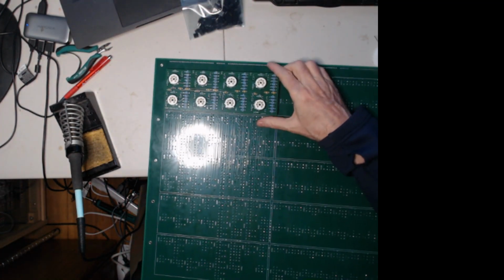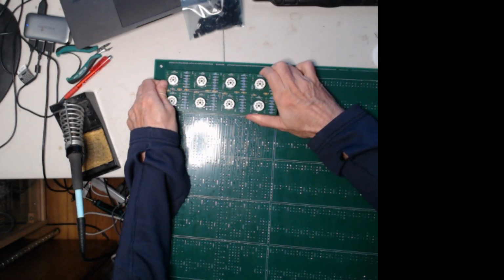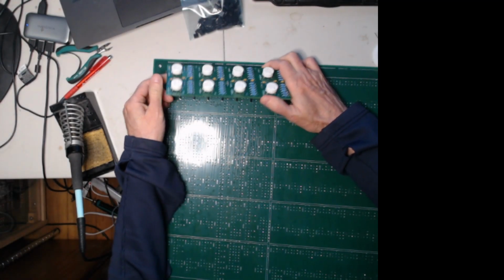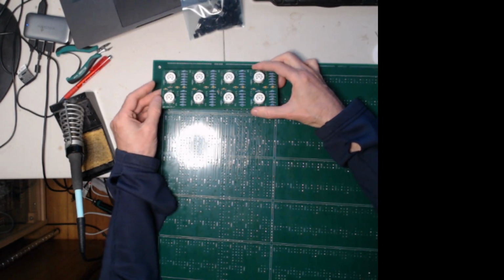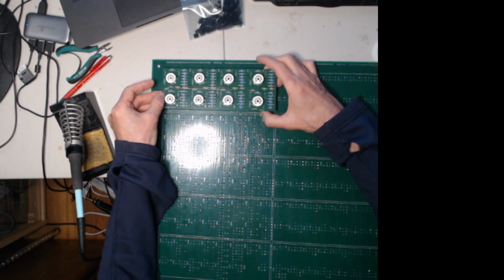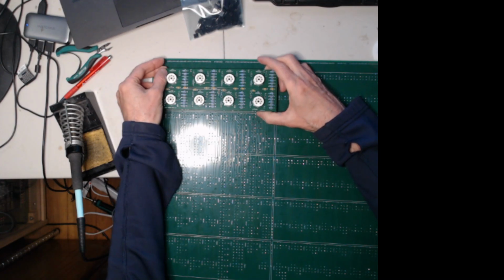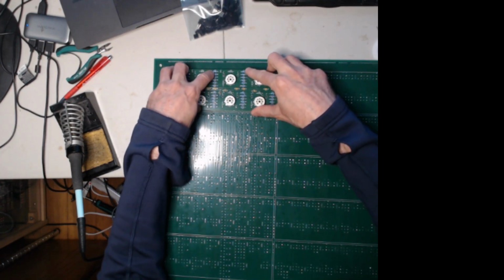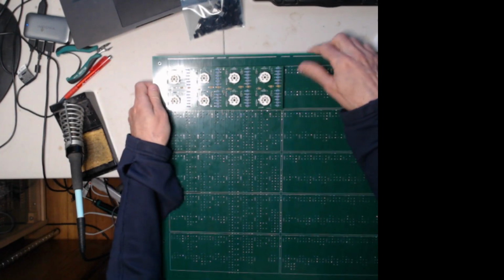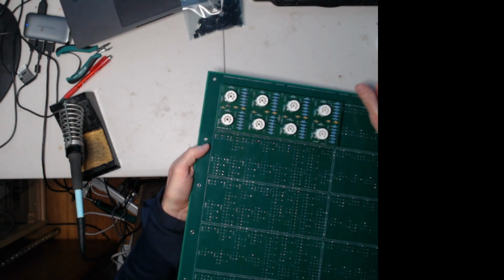So there's one of the two boards mounted in place, right? I should be able to pull it off. The friction holds them on pretty good. There's no real need for any more mounting. Now when you put these in, with the tubes and all of that stuff, we want to make sure you get them centered on those connectors. There's no keying or anything like that, because you could set them offset by 1 or suppose 2 pins, in which case it would not work very well. Might even get a little bang out of it because of the power supply.